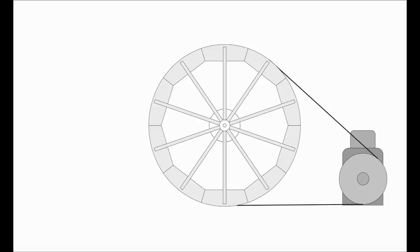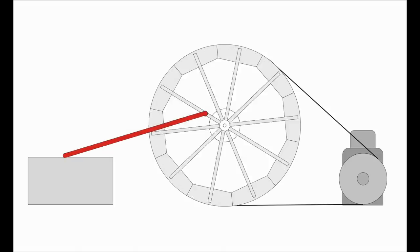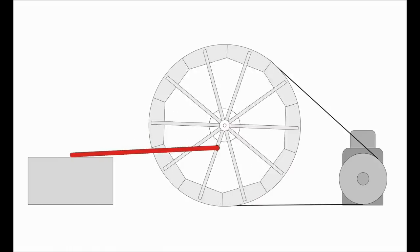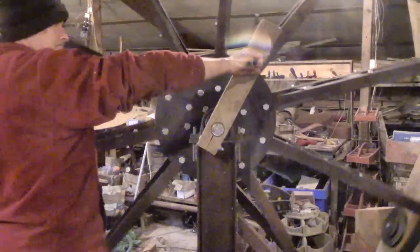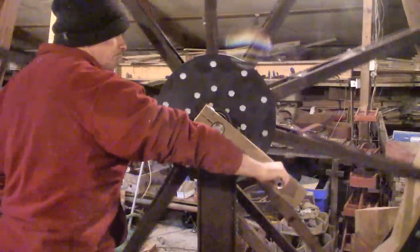I think I could have sorted that out one way or another, but then I decided on a whole new approach. I've decided to take all the cutting, slicing, and grinding action away from the spokes, away from the wheel altogether, and set them up outside the wheel's perimeter. They'd still be powered by the wheel though, via a crankshaft. So now instead of a circular motion, the forces would be changed into a reciprocating linear motion - instead of going round and round, some sort of blade would go back and forth, still at 60 times a minute, still with all the force available from the engine.